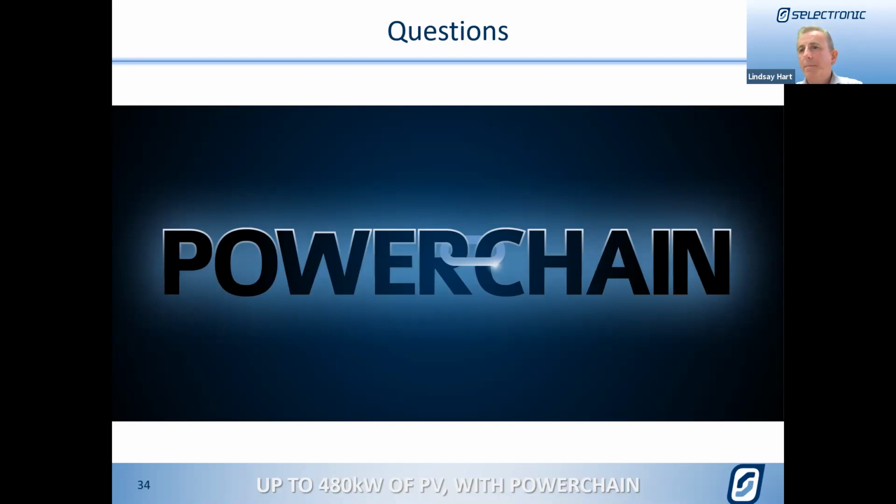Thank you, Ivan. Another question from over the ditch. Can we mix and match different size inverters? So if you've got, say, all Fronius on a phase, then they can be an 8.2 and a 6. We don't care. We can be all the same as long as they're all Fronius or all ABB. We don't mind at all.